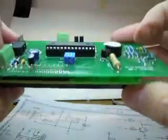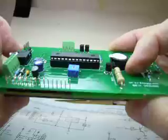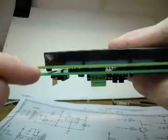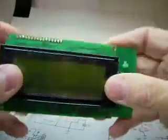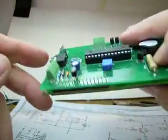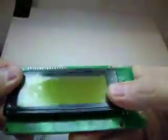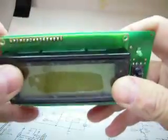That's the printed circuit board. Just check polarity for everything, double check all your connections, and try to avoid any dry joints. There will be some 3mm spacers that go in the gaps where the screw holes are, so once the board is assembled you can screw it together and use printed circuit board standoffs to mount it to a suitable box. I'll give you another video shortly on the OBD2 plug and the wiring.